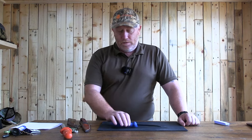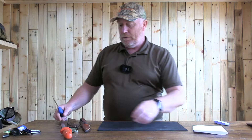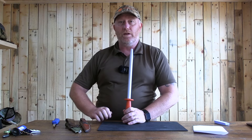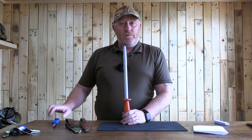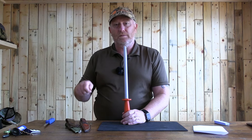What I have here - I'm not going to demonstrate on any of my other knives because they're all razor sharp anyway - but I want to show the effect of maybe just a couple of strops. This knife here is tearing the paper rather than cutting it. I'm going to use a very fine butcher steel. If you're going to use it on really expensive knives, get yourself a decent butcher steel. The diamond-coated ones are great for kitchen utensils, but on expensive knives they put a lot of micro scratches in, which actually serrates the edge as opposed to sharpening it.